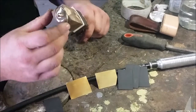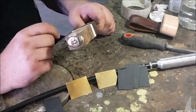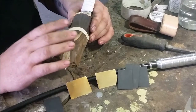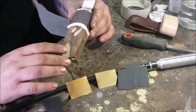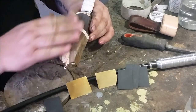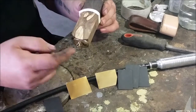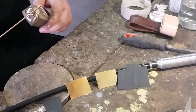I've pre-assembled the handle with the pre-shaped pommel and the pre-cleaned pommel nut on the end, which you saw me make in another video. I've just put it all together to make sure everything fits okay and lines up nice and neatly. You must remember that if it doesn't line up neatly, you need to adjust it before you put your shimstock spacers in. Don't try to use the shimstock spacers to compensate. The handle will be slightly longer because of the spacers, but we've compensated for that by grinding our tang shorter.